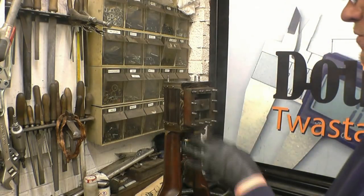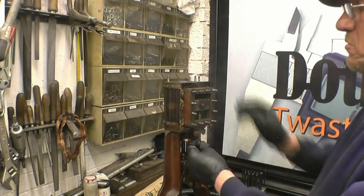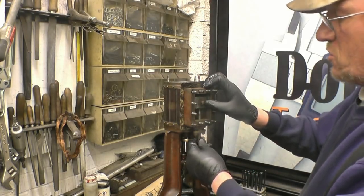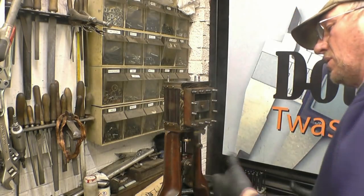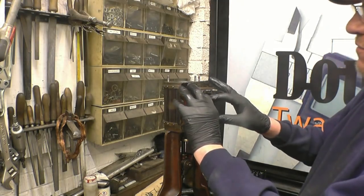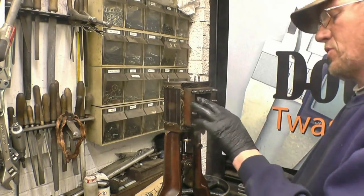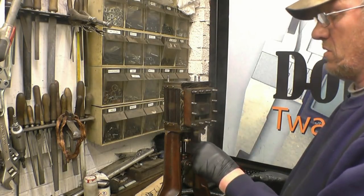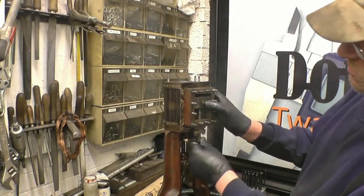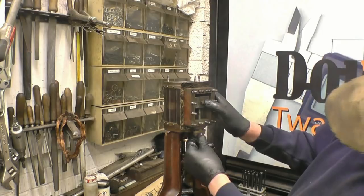When I got this, it wasn't a really good fit — a lot of these studs were bent. I repaired some of them and we've got it to a stage now where it seems to go quite well. One important thing is the valve must be free to float. It's only held against that port face by the pressure of the steam inside the valve chest, moving up and down and covering ports alternatively.